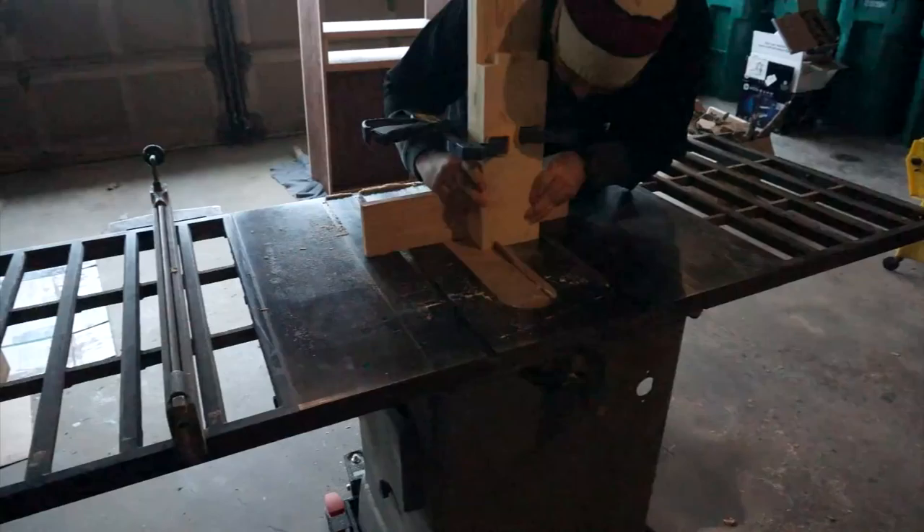The last major bit of construction is to create the drawer for the cabinet, and what I'm using here is just some very wide finger joints, which I'm cutting out on the saw. I'm not using a jig for this. I find it sometimes easier if I'm going to be using wide fingers anyway to just measure out one side, cut them out, flip the pieces over, and then draw out the other fingers. It will require some fine adjustment, but because it was only one drawer with large fingers, it wasn't difficult to do without a jig.